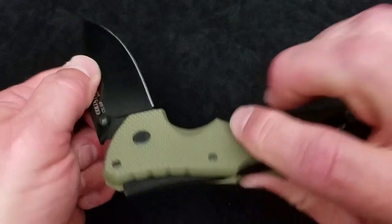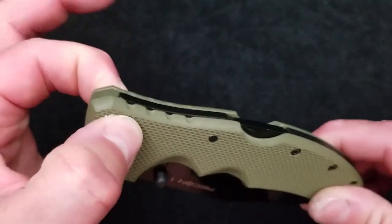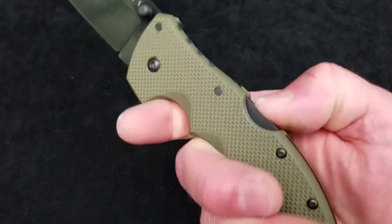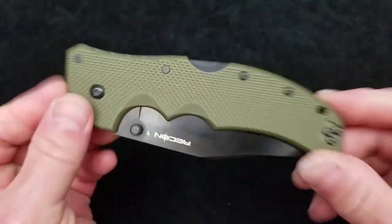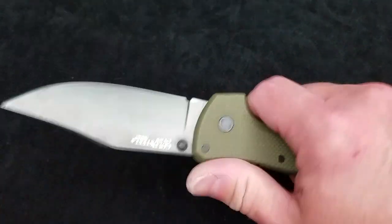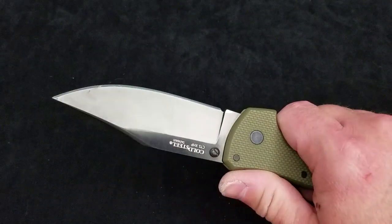One of the reasons that people don't like them, that deep plunge, you really got to push down on that lock tab, and they've got a very stout spring in them that helps aid in the lock strength. So it's not only in the design up here, it's also in that deep plunge, it's in that higher rate spring that's in it, and you know what? It's a little more physical of a lock. I mean, that's a lot of having to move a lock bar against some considerable spring pressure. I could hand this knife to most women, unless they are fairly fit or knowledgeable, they would not be able to close this knife. They would not have the physical strength. You give it to an elderly person, you give it to somebody with a disability, they may not be able to close the knife. And that's one of the downfalls of that knife. But it still offers the strongest lock available.